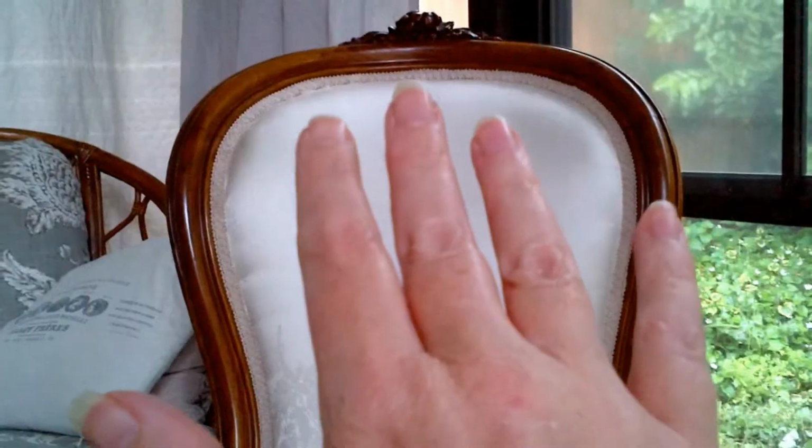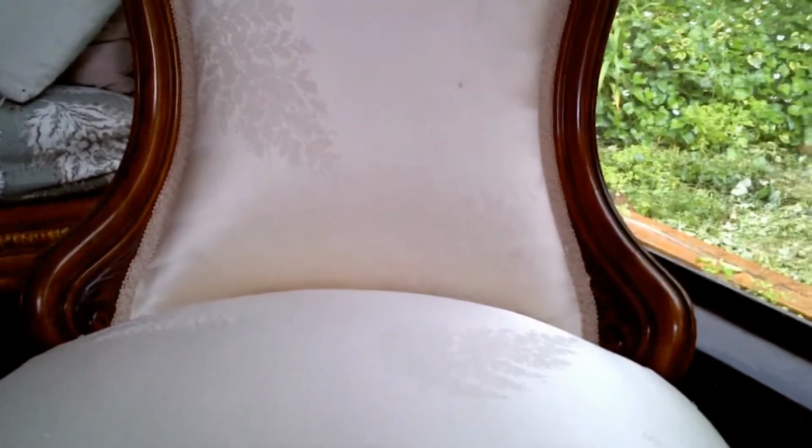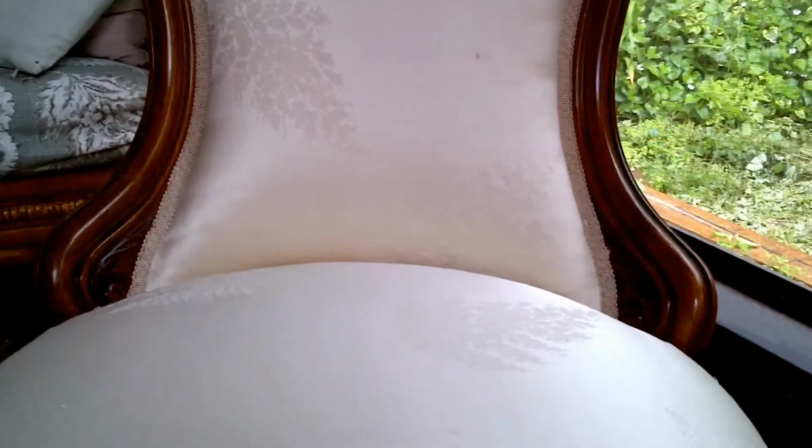On the front of the chair, you would also work starting at 12 o'clock and go across and down. And then for this type of chair, it's a matter of tucking the fabric in, but really far down, using some sort of a flat-headed tool, or risking the health and safety of your fingers to really jam the fabric down in there. The problem being that you don't really know what kinds of sharp things might be down there a couple of inches down. You can add a little bit of glue too on the bottom side of the fabric to help it stay down there.